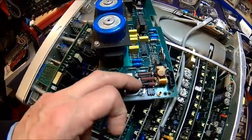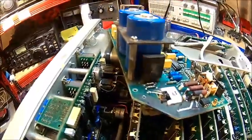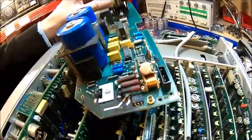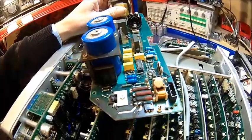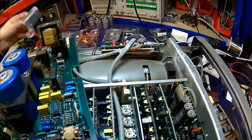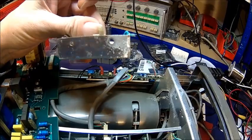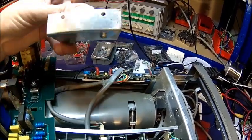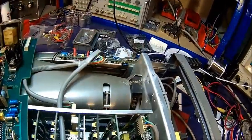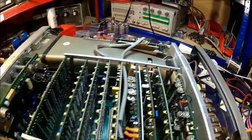I think nothing else is actually dead. I checked all the resistors and they look good. Maybe check the main capacitors for capacitance since this is a bit of a hot area. The other problem is the backup battery holder is completely corroded. I wasn't aware there was a battery inside - it's probably for keeping the settings. All the gunk dripped on the tube.